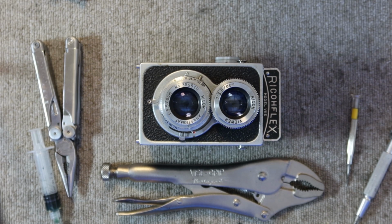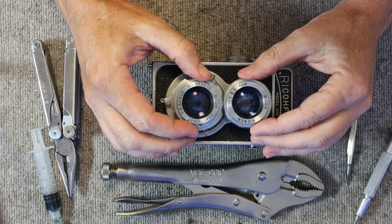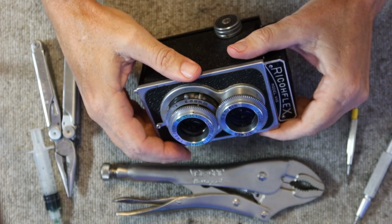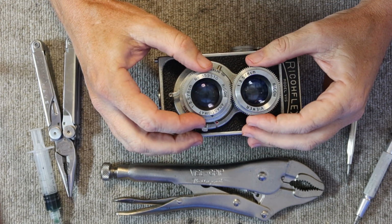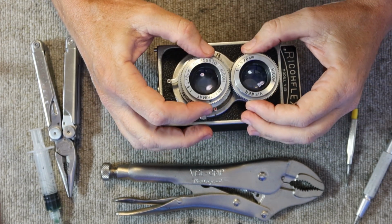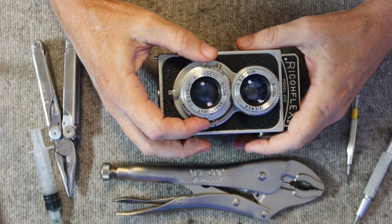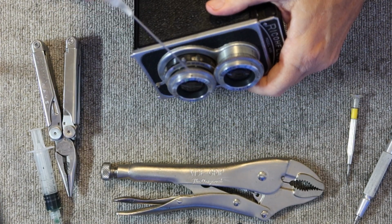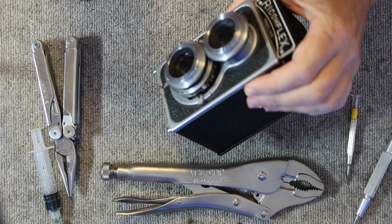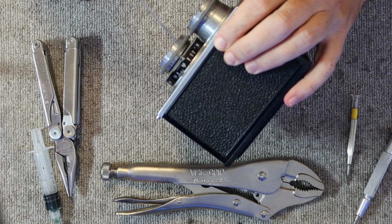Okay, so let's go ahead and get started on these focusing helicoids. And now we're coming to the first part where you have to be kind of careful with these cameras. The most sensitive part, or a part where you're likely to cause the most harm, is removing these gears on the lenses. These gears are held in with these little set screws, and each of these gears has three set screws. And to start with, what I do is I put a little bit of this lacquer thinner on top